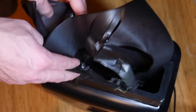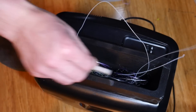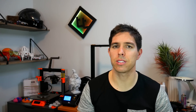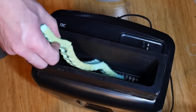It's actually quite satisfying to watch. Anything thin it munches straight through — here's a failed first layer going in. It's self-feeding: once it grabs, parts aren't coming out unless you reverse the motor, hence the need for the top cover to keep fingers safe. But what about thicker materials? This is an old cable chain printed in ABS — even though it fits in the opening, it's just not going to work with this setup. The paper shredder was always only Phase 3.